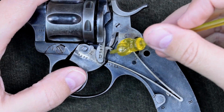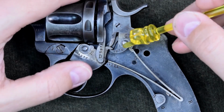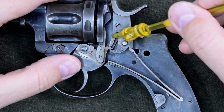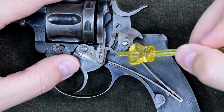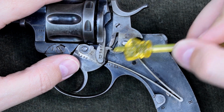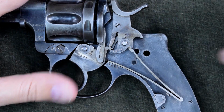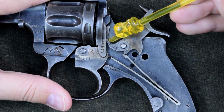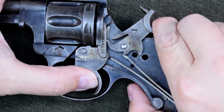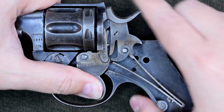We have what we'd currently call a Marriott style of lockwork, although I'm still trying to prove that evolution out. In other words, we have a sprung hammer nose that serves for our double action, and we have a little notch on the hammer extension and a little notch on the trigger extension to serve for our single action. So if we cock this guy back, yep, we got our little kissy lips right there, holding her in place, pulling the trigger separates them, and it all comes crashing down.